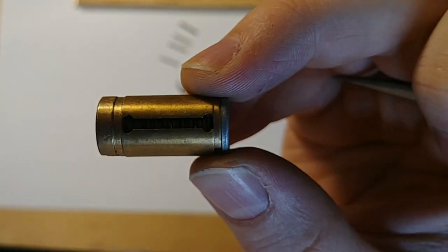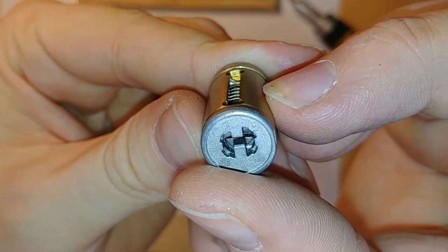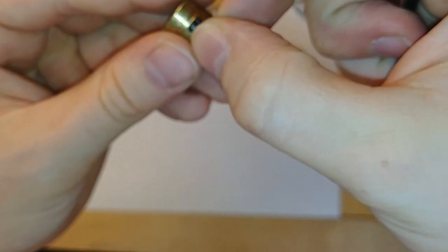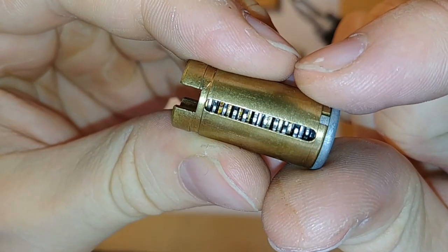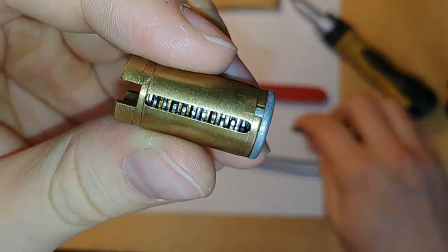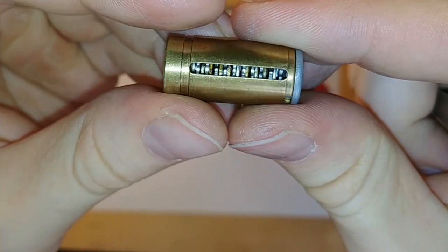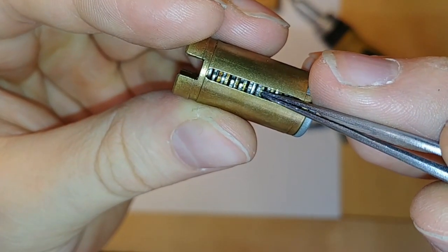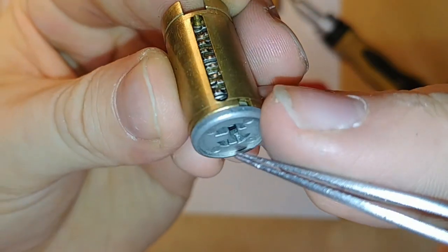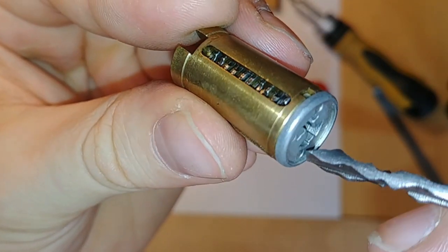So let me go to manual focus and show you in detail. Here we see there are no gates, there's just the hollow part. And that's exactly where this sidebar comes in. It's quite handy to have it always in when you're playing with the lock, because on the other parts at every sidebar we have true and false gates, which you can see here. I'll also later take the discs out. I just want to show this is a false gate because it's much higher than down here the true gate. If you look from this direction, you can see that there's actually a very big height difference.